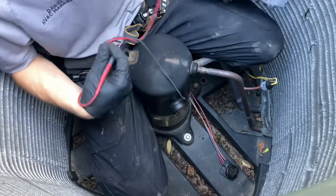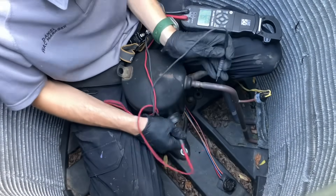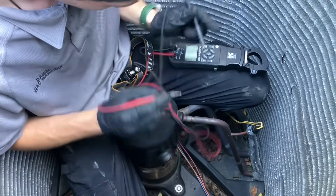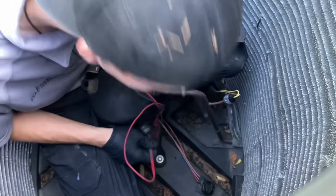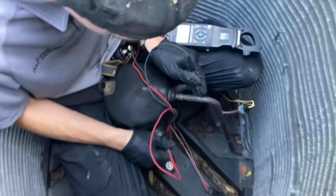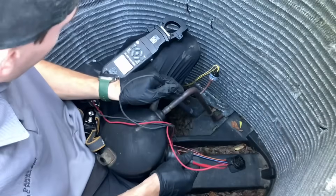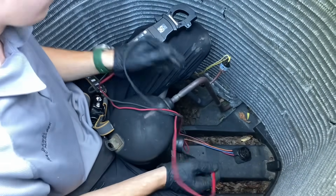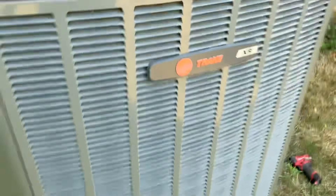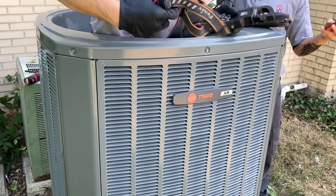All right, we're going to check resistance on the terminals of this compressor. Common to start. Common to run. Start to run. Uh-oh. Nada? Shorts to ground, baby. On this episode of Abandoned Mega Mansions — this compressor shorts to ground. It's uncensored content right there. That does stink. They say it's hard to stop a train unless you got a shorted compressor because of a dead motor.